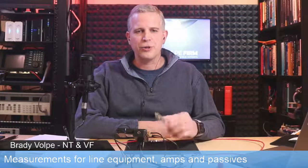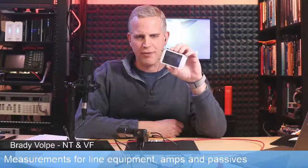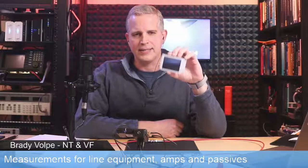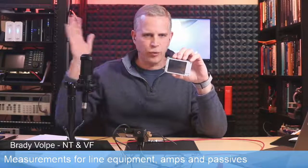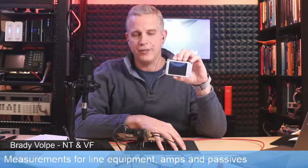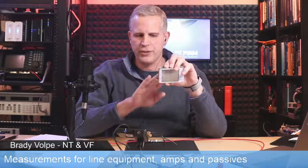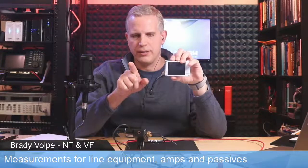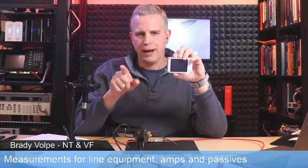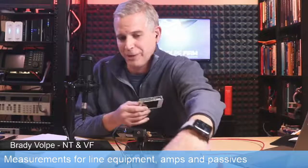And the super cool thing is, folks have come out with this little tiny $35 device called a NanoVNA. It does the same thing as the 20, 30, 40, 50 thousand dollar units, and they go even higher in cost. Vector network analyzers are professional things that we used to work on. So what this little device does is it sends out a signal, and the signal going outbound is injected into any piece of equipment that you want to test. And we're going to see this real shortly.